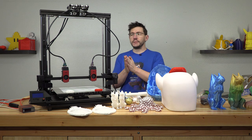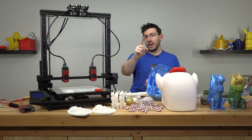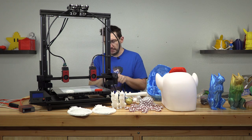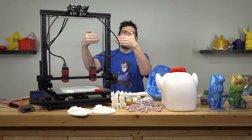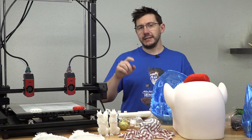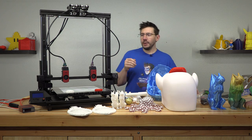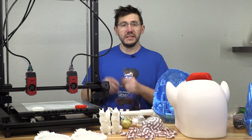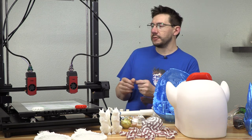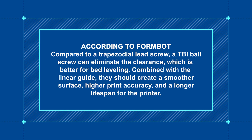Industrial linear guides — it shouts from the web page. Originally when I viewed the webpage I thought these were linear rails. I was like, linear rails, that's a really good idea! But they are not linear rails — these are guides. It's got little metal wheels on either side that grab the guides and assist in movement. I'll be honest, when I found out it wasn't linear rails I was a wee bit disappointed. The Z-axis, rather than being a tiny little lead screw, has these two giant ball screws, and ball screws allow a much finer range of detail in movement. I'm not a ball screw expert, but I believe having ball screws is better than having lead screws.